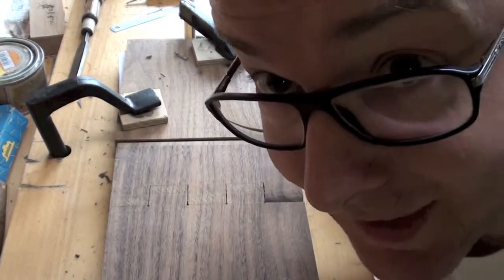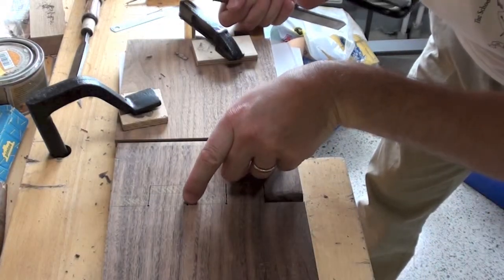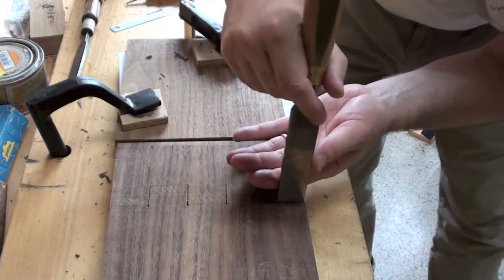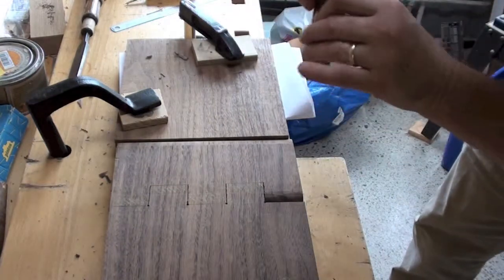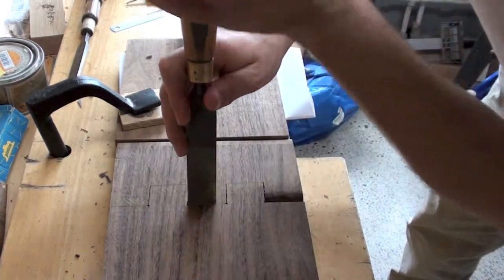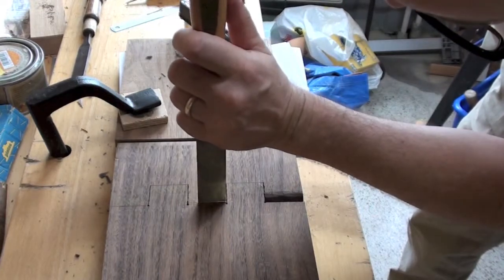Okay, we're going to have a look at cutting the knuckles. This is a bit tricky. I've scribed a line here, and we have the angle of the knuckle cut already in this instance here. So, firstly, nice solid firmer chisel, nice and sharp. Pop it a couple of millimeters, perhaps 1/16 of an inch, this side of the line, chop down, and take that all the way across.